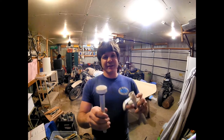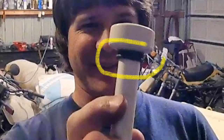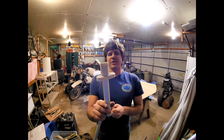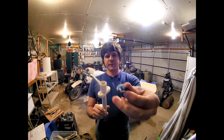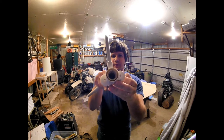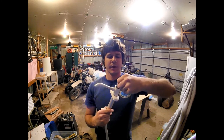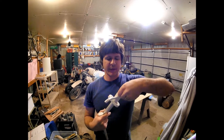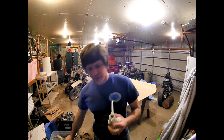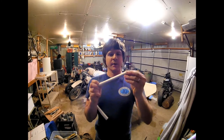More or less solved the problem for us. I decided to put two extra O-rings here at the top of the shaft so they're easy to find if I ever have to rebuild it again. So you have the main shaft here — there's an O-ring here, it's beveled, and that piece goes down into the groove. The O-ring I got came from a bin, so I'm not exactly sure of the size, but when you place the O-ring on, you want it to be pretty snug, kind of like these ones.